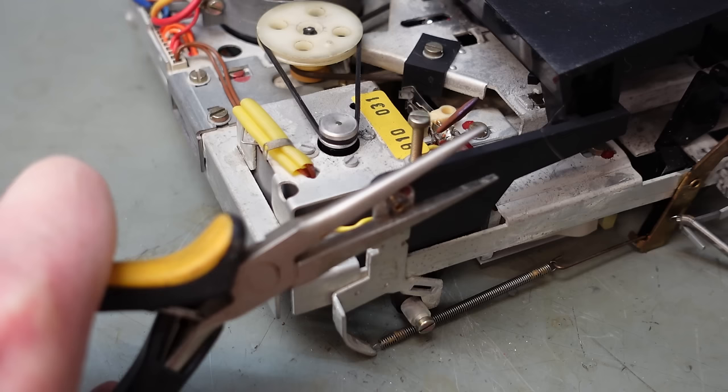So make sure this is free to move, which it is, not too much play. I'm going to drip a bit of shellac on there just to hold the screw in place. Some people use nail varnish instead, but I haven't got any. Just give this a little pivot, a little shot of grease, as it had originally. Now more springs went on here, which clips into this little plate, and then over this dowel. Same trick over here.